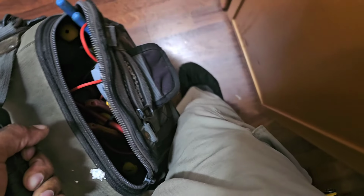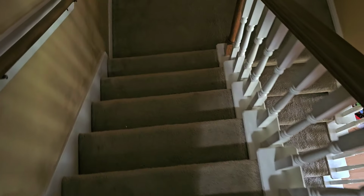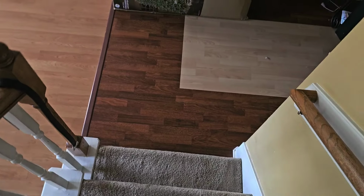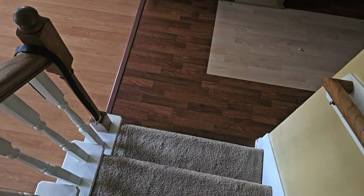Yes, so I got a bad fuse up here. I put a new fuse in there. But the outside unit is causing the fuse to blow, so I gotta go find out why. The outside is tripping, blowing that fuse. So I'm gonna go outside to the condenser, and then I'll come back up here. But the blower running, so there's something going on out here, though. Yeah, that should be simple. Probably just a contactor. All right, you say I can get to it from the front yard or the backyard? No, from the front.